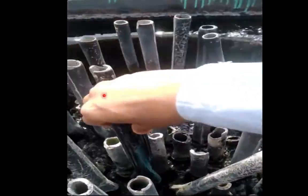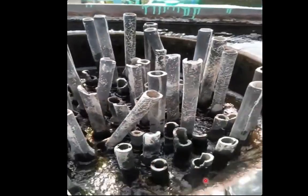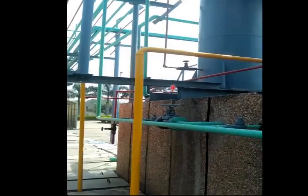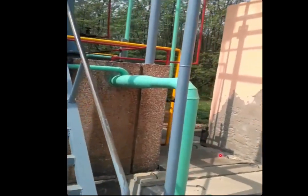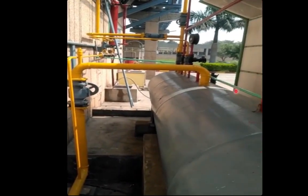The swirl insert is placed like this on the top of the tube, and the tubes are open to air from both top and bottom. At the bottom, this is how the water will be falling into the sump, where it is collected and discharged back to the cooling tower. These two yellow lines are for collecting the liquid ammonia from both condensers and taking it to the receiver. At the bottom side we can see the liquid ammonia line from the bottom of the condenser — these liquid lines merge together into one single line and via this trench go to the receiver tank.